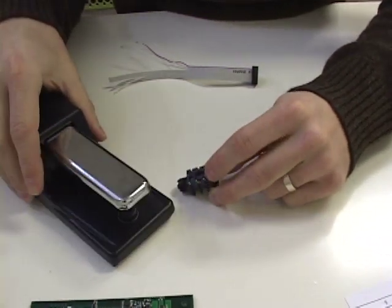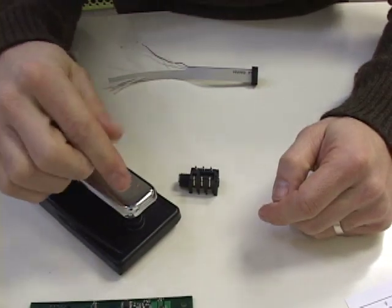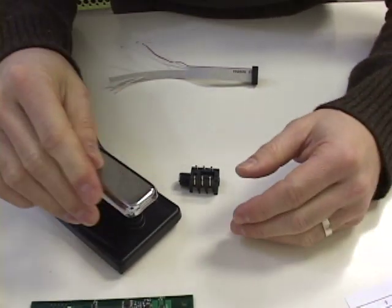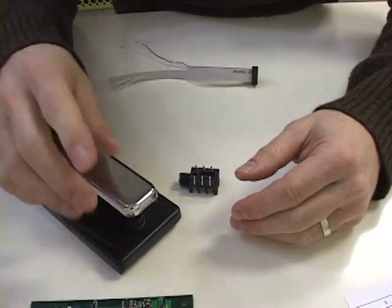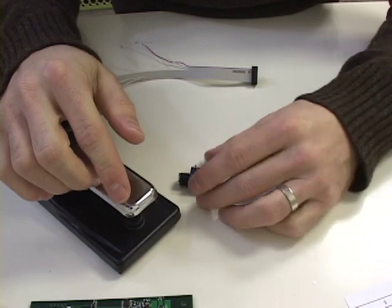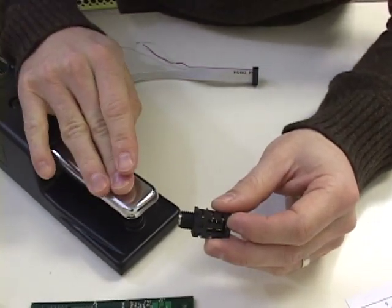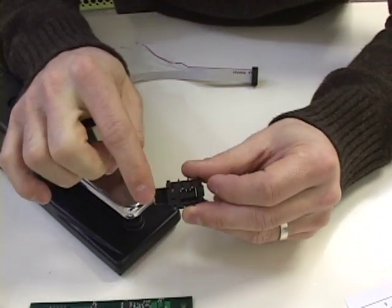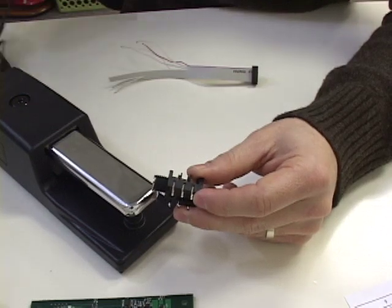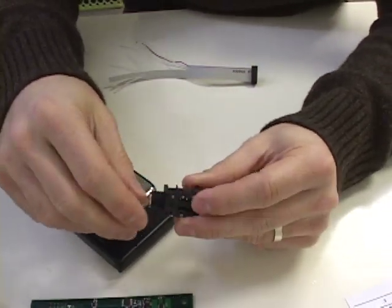For my example, I'm going to be using this for a zoom effect for video. I want this to be zero and I want this to be 127 — that's the MIDI continuous controller range. Depending on if I want this end to be the high number or the low number is how I wire this. I know this because I've taken a multimeter and measured the resistance on here to figure out how I need to wire it.